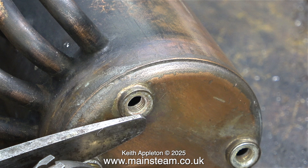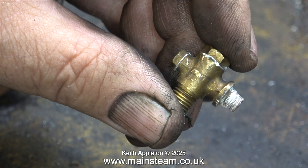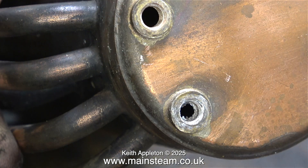There's a big problem with the check valve on this boiler. I'm using my large pair of workshop scissors, of which the ends have been rounded, to remove the fitting from the boiler, because there's very little thread left. It definitely won't screw out of the bush — I had to lever it out with the point of the scissors. This is not looking good. I could attempt a repair with some silver solder, but I really don't know whether it's worth it.